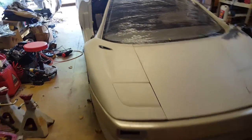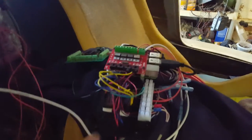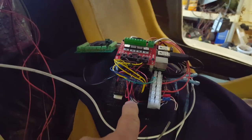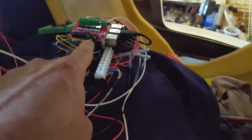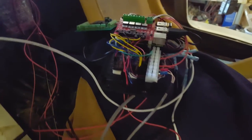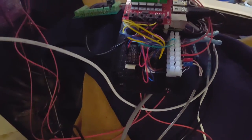Just moments ago, we were able to initialize this box, which consists of two Teensies and a Raspberry Pi 2 with another board on top to fire the injector — just a couple of FETs. This little board is doing 12V to 5V so we can have a 5V source. The Teensies are running on 3.3V.